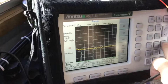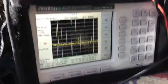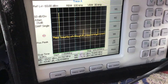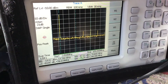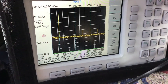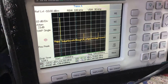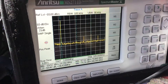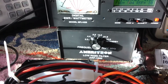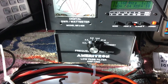We've got the waveform there, it's looking pretty good. We'll do a sample on the spectrum analyzer — there we go. As you can see, we're at minus 19.5 dBm on the primary. Third-order is at minus 53.82, then the fifth at minus 57, and the seventh at minus 71. And there is absolutely no second-order product, and of course this is after the Ameritron ARF-1000 filter.